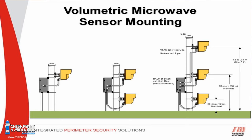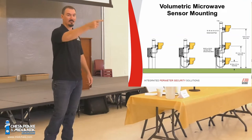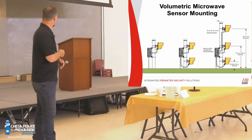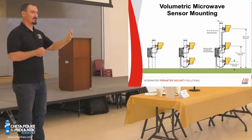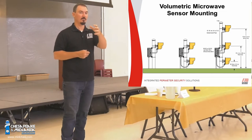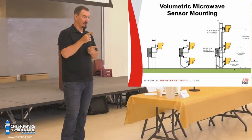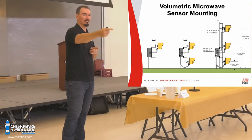When you align these microwaves, you go left and right, and up and down. Microwave energy reflects — I can put a transmitter and receiver here, point them at a wall, and have a good zone bounced off that wall. You can use reflector plates, bounce off buildings, bounce around corners. With this RF energy it starts narrow and gets wider. We can bring heads 30–40 feet back from a building, put a transmitter and receiver on the same post pointing at it with a reflector plate, and have a zone going all the way up to that building.